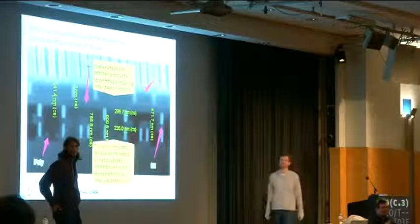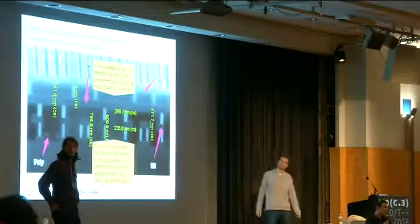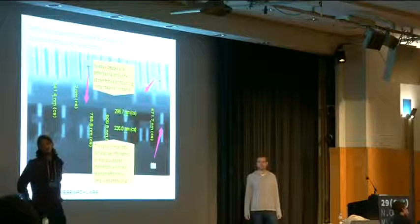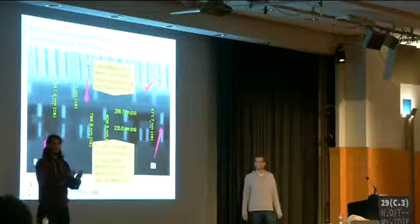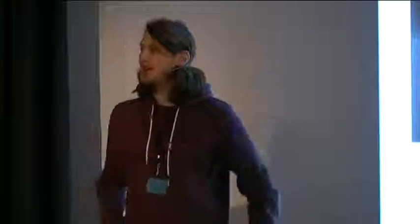I wonder, you use this scratching method. Wouldn't it be possible to use a piezo actor that gives a vibration to the probe? I understand you want to do it like a dentist removing dirt from your teeth. We thought about that, but scratching is more feasible. I don't know how to attach a speaker and how to make this supersonic stuff. With scratching, you have full control with the micropositioner. You move it back and forth, or you rub at the side of one of these traces and suddenly it breaks. It's doable, and I practiced this very reliably in the last time.